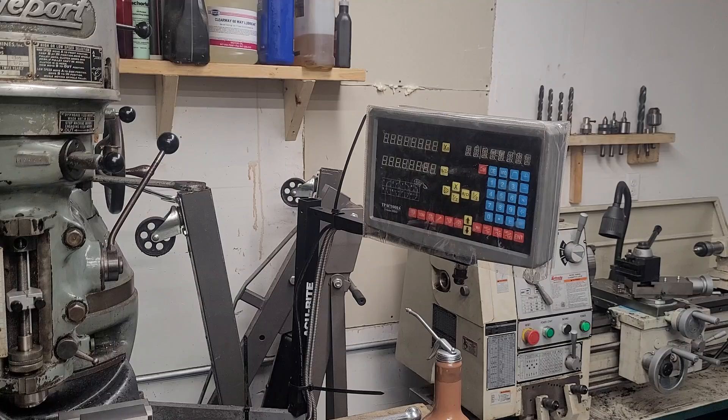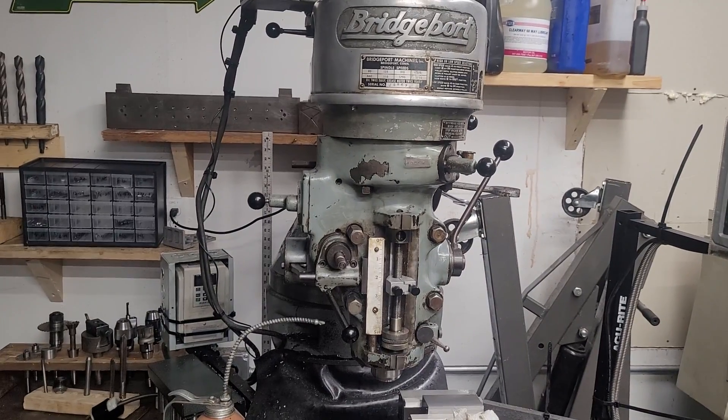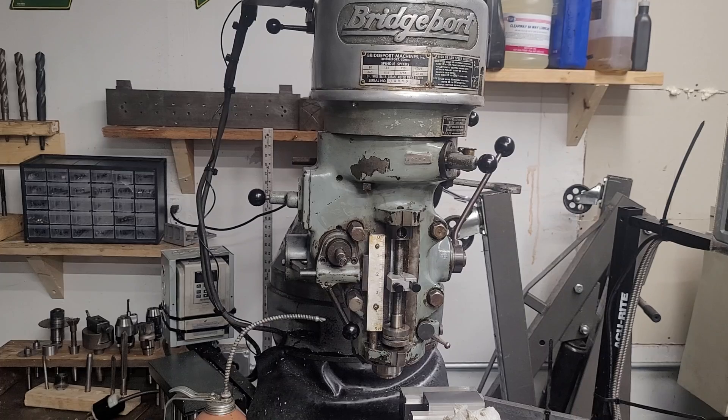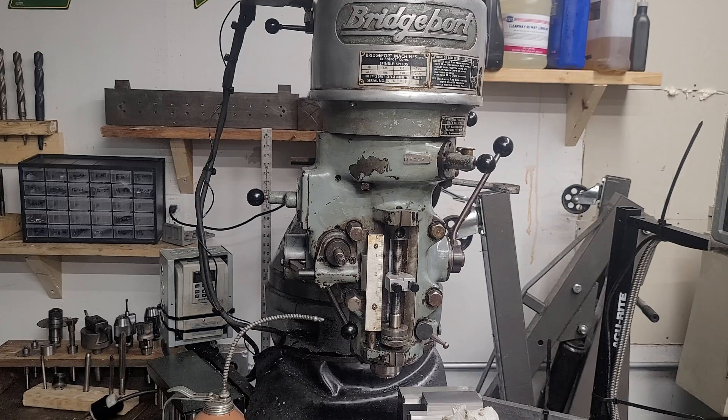That's a factor in your precision. When your Gib adjustment isn't where it needs to be, you can move a full thousandths of an inch. On my knee, I move about one-half to three-quarters of a thousandths of an inch when I lock and unlock the knee. I've played with it, so I either have the knee too tight and it doesn't move, or it moves when I crank it — it's a trade-off. You kind of learn that with your machine. We're getting into compensating, which is a deeper level than just five tips. But be aware of your Gib adjustment and be aware that they're going to move around.